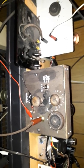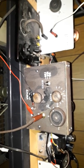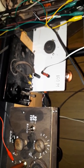It's kind of remarkable for such a simple radio, about 12 parts, and it was built as an experiment. Didn't really know what to expect, but I do operate 160. As you'll see, my transmitter is warmed up and ready to go. And that's a number 10 tube, series fed Hartley.